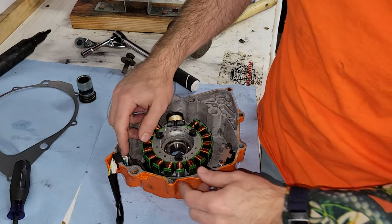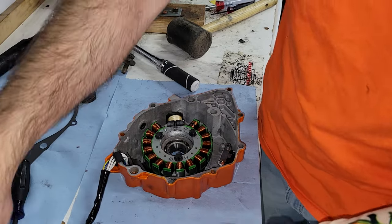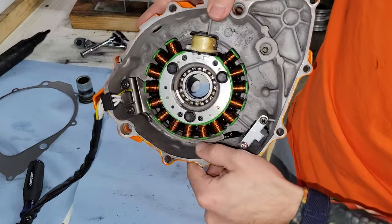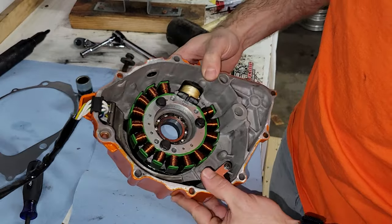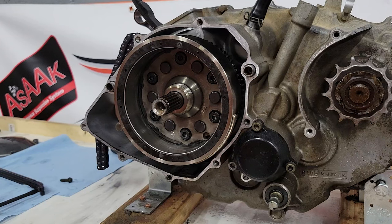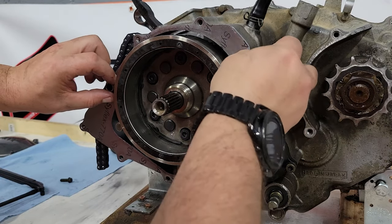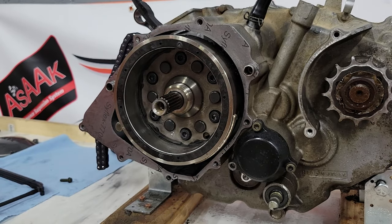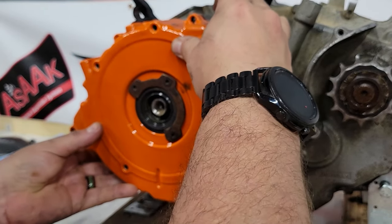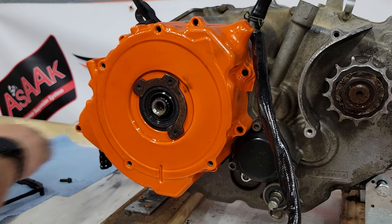We had some slack with the blue and green wire so we just went and pulled it through the rubber grommet — now you can see these will be a little longer because we pulled them through. We also tuck them up in there so your wires should be nicely tucked out of the way under your plate. Once you actually put it on it'll smash this down even more. Next we're going to put the gasket on, and don't forget to throw your dowels back in. This should go on real easy — a couple of taps.